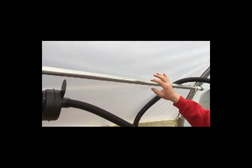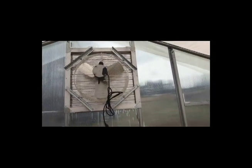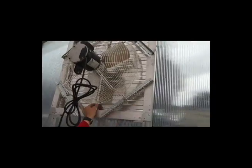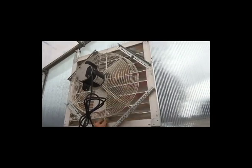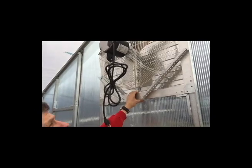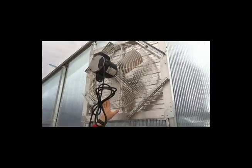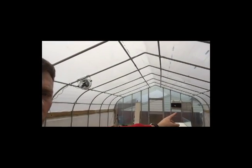This inflation kit draws air from a regulator over here to this unit and inflates air between the two pieces of poly. The last piece is this exhaust fan here. I had to do a little retrofit because this shutter is actually the intake shutter from the other side, but I had framed it for this opening, which needs to be the exhaust. So I put some angle braces on here — this thing is bulletproof. The exhaust fan is exhausting out of a 30-inch opening, and the intake is in the 24-inch opening.